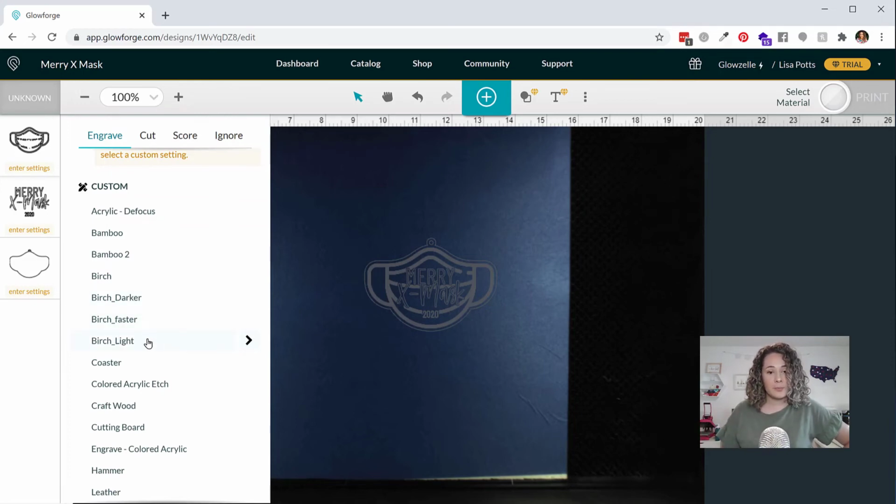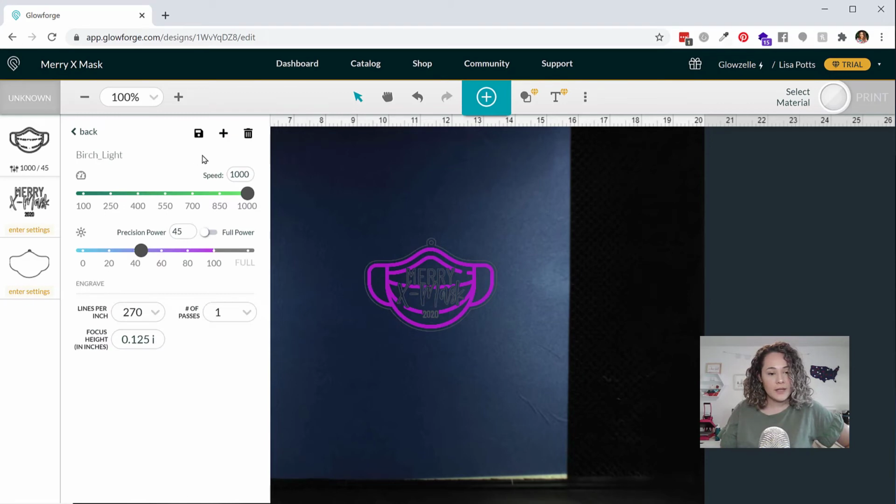So I am cutting on birch plywood. I have the plywood that I use from Woodpeckers in the description below. Birch light, and let me show you. I'm doing my speed at 1,000, my precision power at 45, and I'm just doing 270 lines per inch, because I want this to be pretty light, I don't need that.